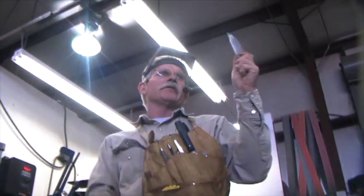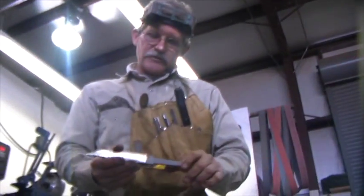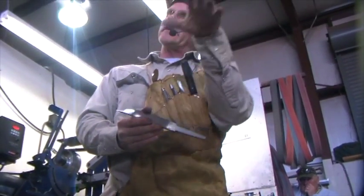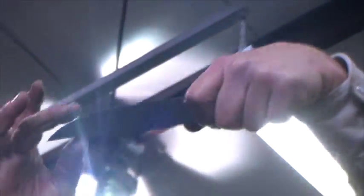From this part to this part, your cutting edge looks centered here. You have a scribe line right there to look at — you can visually look at that, and you still have room to adjust that as you go. But now your tip is in the middle. As you see, a little bit of thickness left here, so we need to blend that.